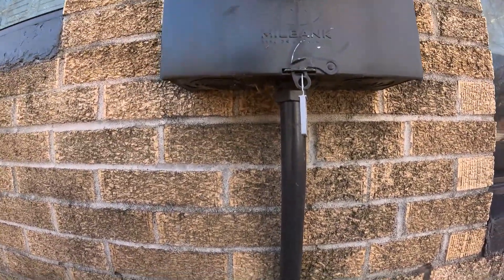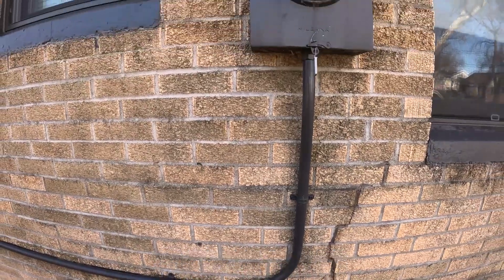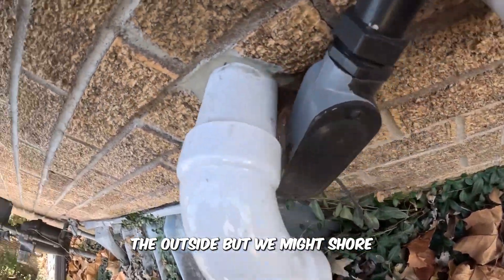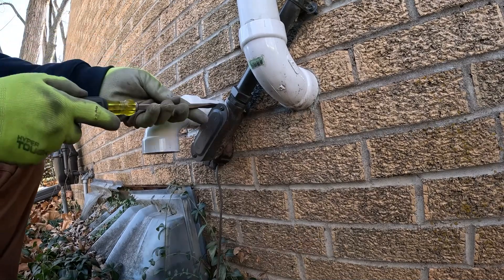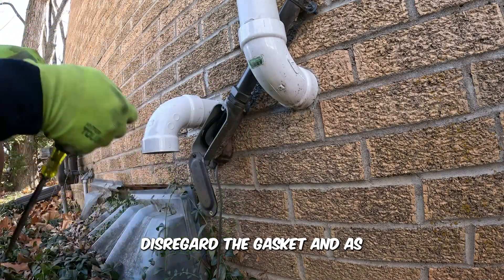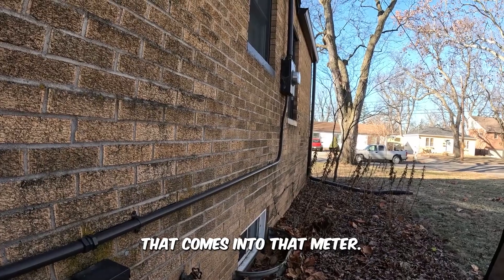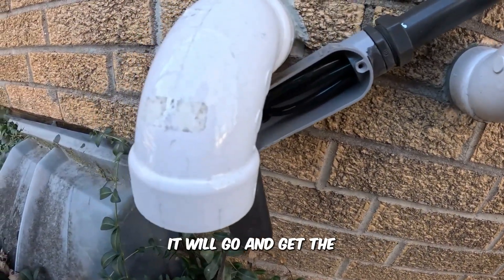It's kind of a small pipe for this — usually for newer installations, anything that is 100 amps, we go inch and a quarter pipe, but it looks like that is an inch. Let's go ahead and open this up because they do indeed have an LB. It looks like they duct sealed around the outside, but we might shore that up a little bit better. We'll open it up and disregard the gasket. As you can see, they duct sealed the outside but they did not do the inside. If there's any kind of opening into that meter and it drips down, it's just going to keep pulling and eventually get down here and get the condensate right into there.